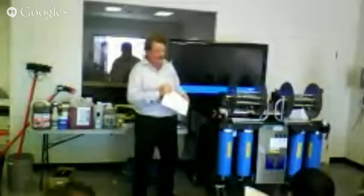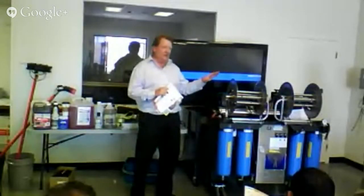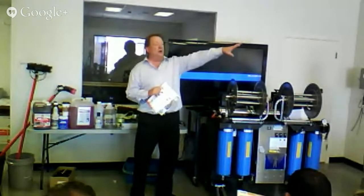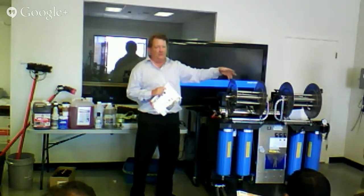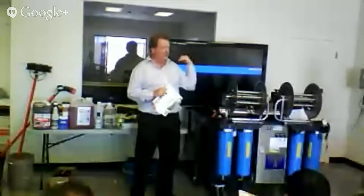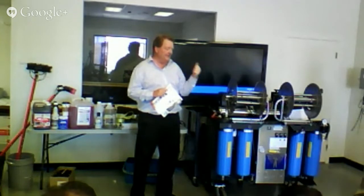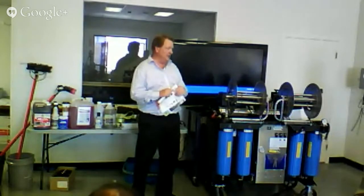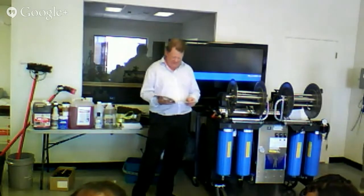So today he's got a hot water pressure washer out there that's going to be driving a surface cleaner that's doing recovery into a recovery pump, and we're going to pump that water off to an appropriate place for it to be disposed of. You don't want to dump it into the regular gutter because that's not any requirement. So you're talking about a sanitary sewer or on property in a garden bed, something like that, where it is not going to run off property. And we'll be showing you that up there.